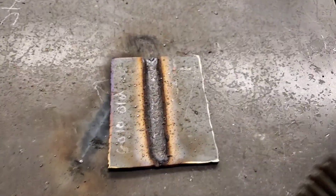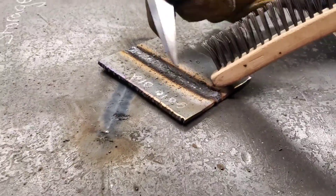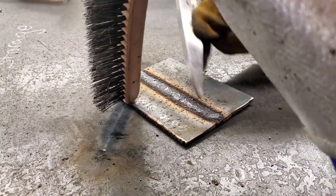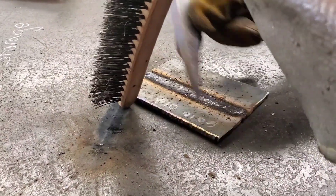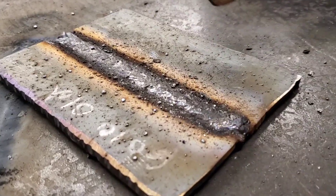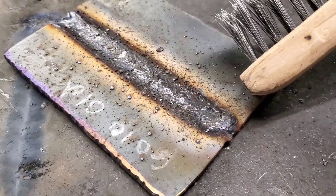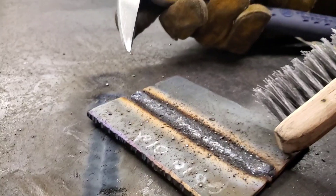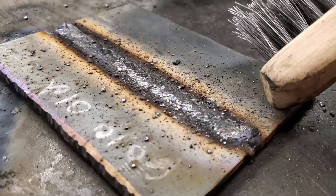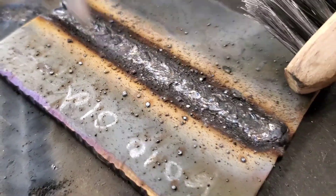Before I chip this, I'm noticing the flux coating is not very thick at all - it's not even on top of that weld, like there's no flux at all. That rod's pretty thin on the flux. I've never encountered this kind of situation. You could almost tell they were kind of wet when running them - they weren't dry whatsoever. I know they're a cellulose-based rod which means they need a little bit of moisture, but these were almost a little wet. It was really difficult, and I'm noticing maybe a couple of specs of porosity in this weld.